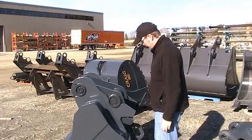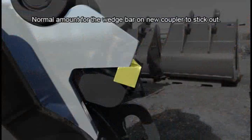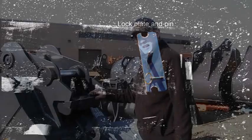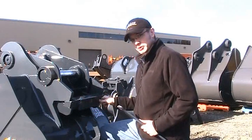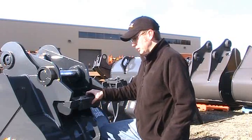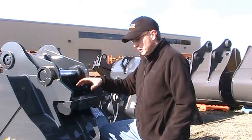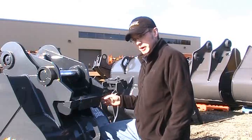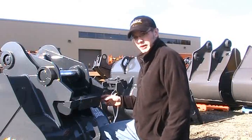Moving on to the pin-up of the Wedge Bar. We supply a wrench in order to tighten down your bolts on your Wedge Bar, and once you have your Wedge Bar tight on to the lugging of the bucket, there's a locking plate that will go over top of it. This locking plate is meant to keep the bolts from turning out when the coupler and bucket are in use on the excavator.